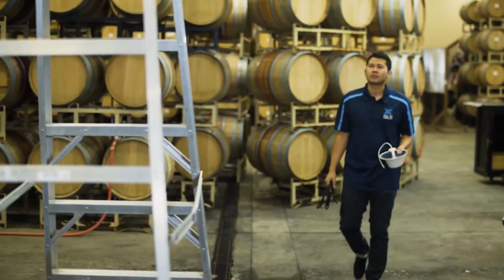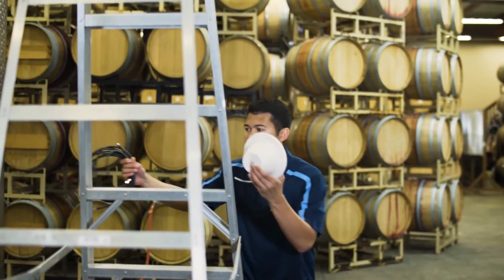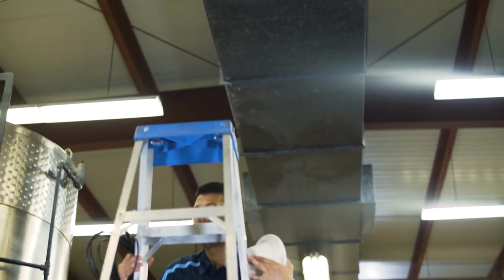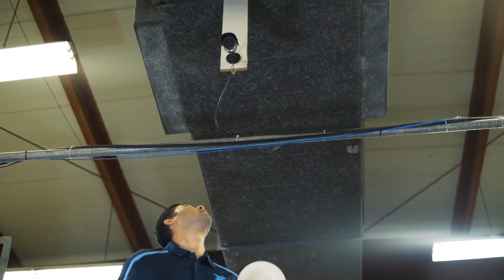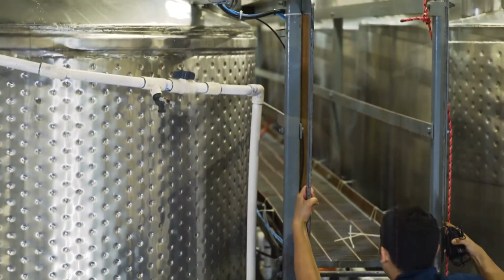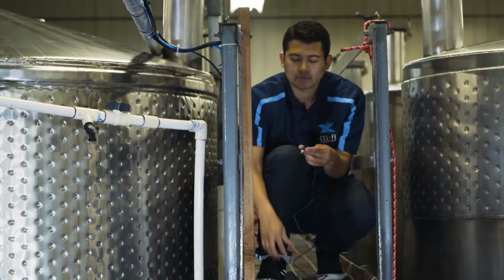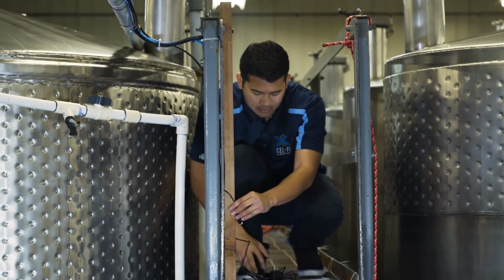Continue the planning process. Next, find a location for the server antenna in an area of the building where improved coverage is needed. Keep in mind that maximizing the distance between the donor antenna and the server antenna will provide maximum gain and a larger coverage area from the server antenna. Now we need to find a spot to install the Cel-Fi GO unit. When choosing a location, make sure you find a spot with good airflow, close enough to a power outlet, and close to the donor antenna. This will help ensure maximum input signal from the donor antenna.